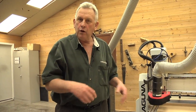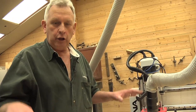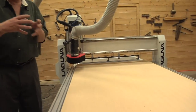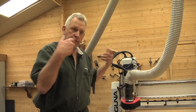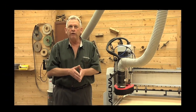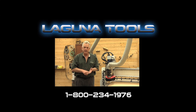Let's review what we did. We started with the actual vacuum table, put the gasket material in the grooves, carefully lowered the spoil board blank onto the table, aligned it, and made sure we didn't roll the gasket up. Then we fly cut the surface using an inch-and-a-half straight router bit, removing the compressed surface on the new MDF — about 60 thousandths — flipped it, and did the same on the back side. Once finished, we measured the spoil board, entered it into the control, and touched our tools off using automatic tool touch-off. I hope you enjoyed this video. For more information, go to lagunatools.com or call 800-234-1976. Thanks for watching.